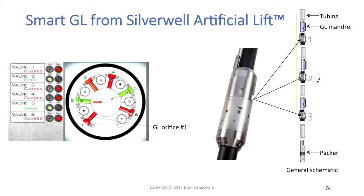You've got full flexibility and full control of your gas lift injection points. The biggest disadvantage is that the system relies on one electric cable run from the surface. In case of a failure in one of these electrical components, you're going to lose control of the smart gas lift module. This disadvantage can easily be overcome by installing a side pocket gas lift module right next to your smart gas lift module. If the smart gas lift system fails, you just go back to a standard configuration without needing to pull out the entire completion.